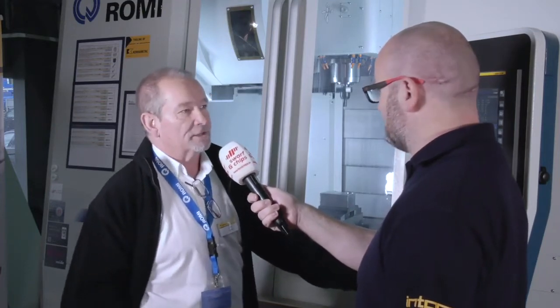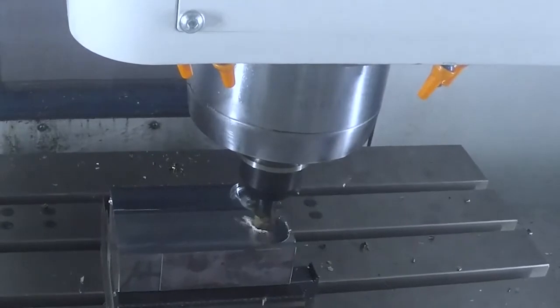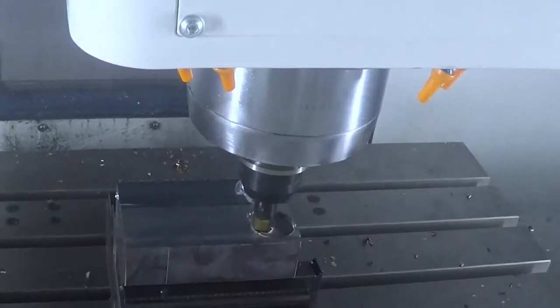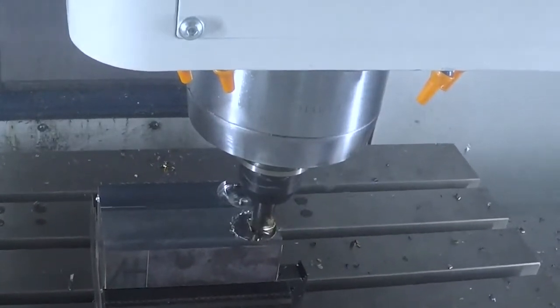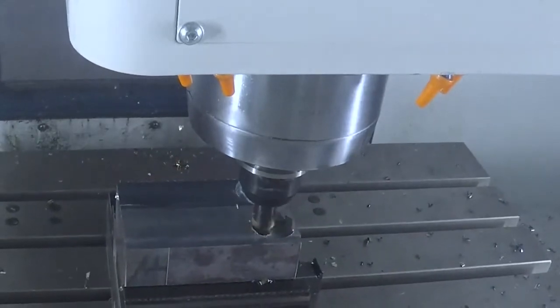This is the tech - the bit for the machine. We're able to take 44 diameter. We could have gone 44 deep, one times diameter, but we're keeping the demonstration concise. This next operation shows another way of entering into material. It's much quieter - this is an end mill with a two-edged insert. It's not the most economical, but it can plunge and go straight into the work. We're doing 38 diameter and two millimetre depth passes in a helical means - typically to open up a pocket from solid.